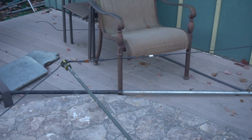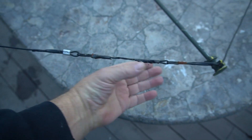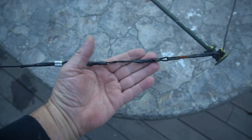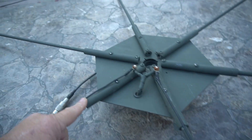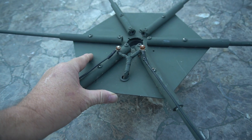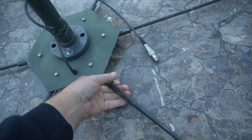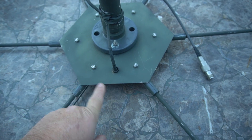Let me go to the other side and show that to you — it's basically the same thing. Your reflector ends here in the same place it does on the other side, straight across. You get your space, and then your other side of the dipole that goes around and back to the middle again. What I used here is three-eighths Schedule 80 PVC, and I just have everything painted green to camouflage it a little bit. And here's the bottom side.